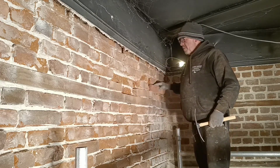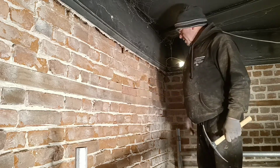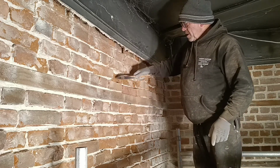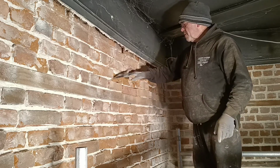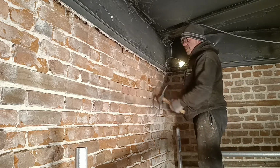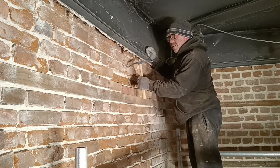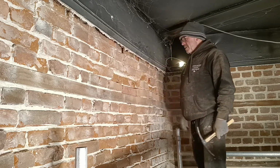That's it, that's fine. And that basically that's it, you need to get that deep all the way along. So just a quick video, show you how to do that. Like I say, take the soft part of the brick away, then you're left with the pretty solid stuff. Leave that there, there's no need to take it out, there really isn't. Especially these ones here, because you know it's a 9-inch wall. You want to keep the integrity of these, definitely. Yeah, and that's it.